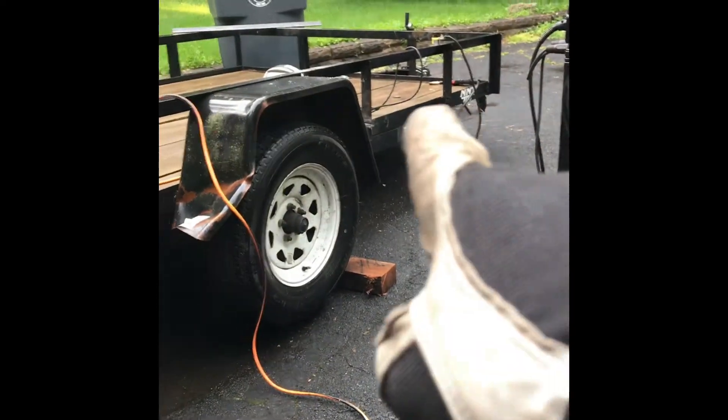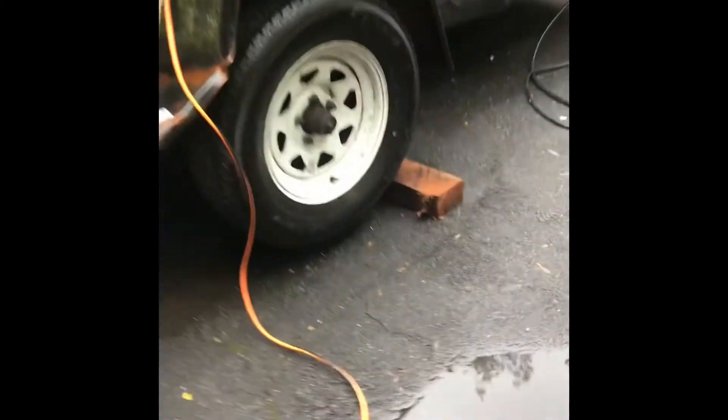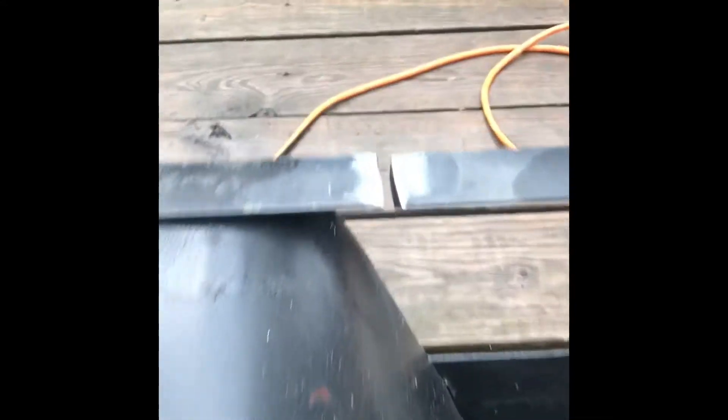This whole piece was arched right here. This whole trailer — I've got it jacked up here. They cut a piece out because they want to run quads up here, but there's like no support down in here. This whole frame bent right at the axle — you can see how much further it has to come yet. So I'm gonna tack this in place, weld it out pretty good, draw this in, weld it, and then I'm gonna run braces on the inside here and then cut that section.